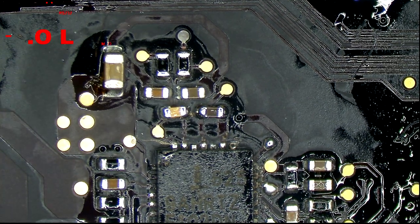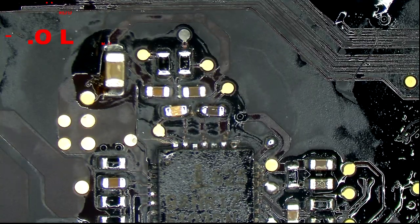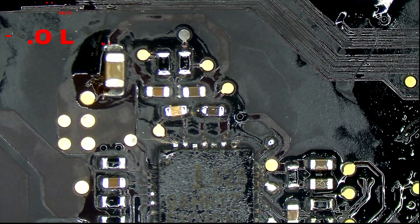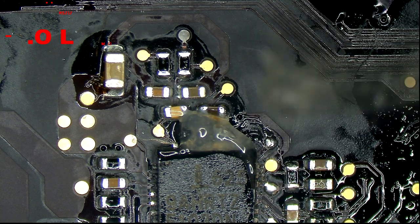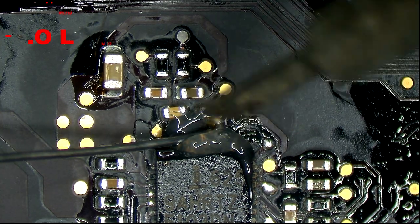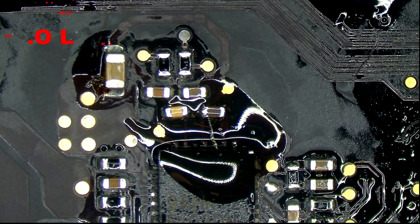All right, I'd say that we're pretty safe here. Except, I didn't really get the top done nicely since I was using that large BCM2 tip, which is really inappropriate for QFN soldering. I was being lazy. If you caught me being lazy there for a moment, I really should have had the something else on. It's a little better for that. But at this point, it's clear that our issue with the short on the current sense line is gone, and it's, see, much cleaner. Much cleaner.